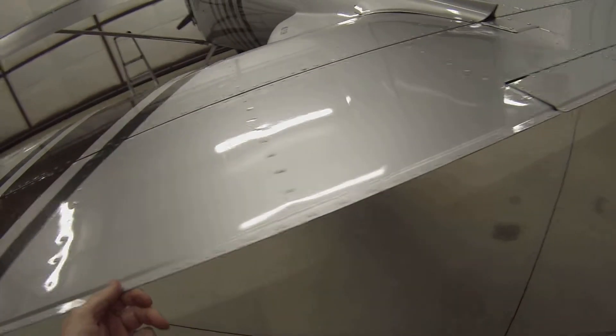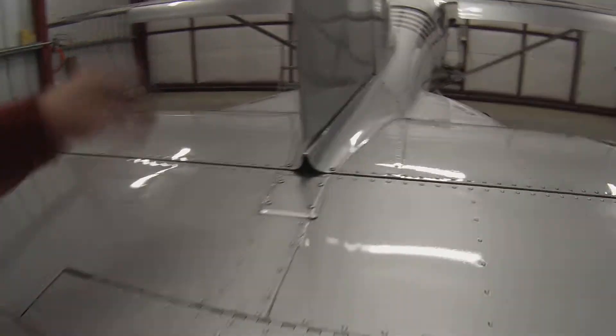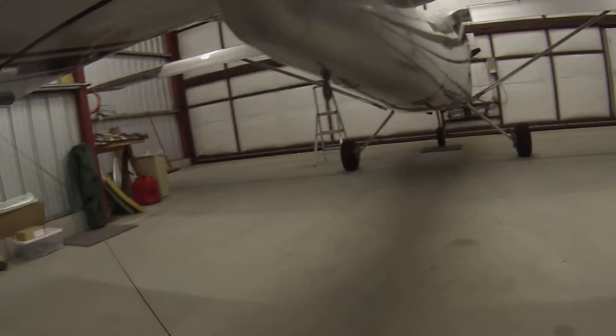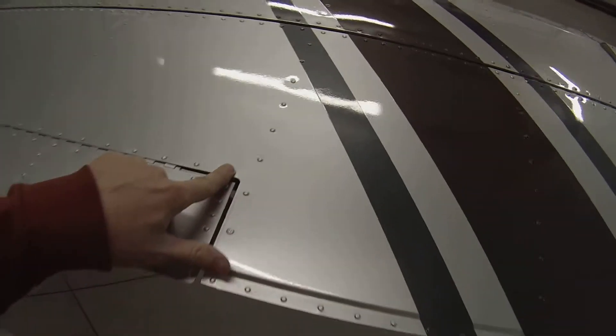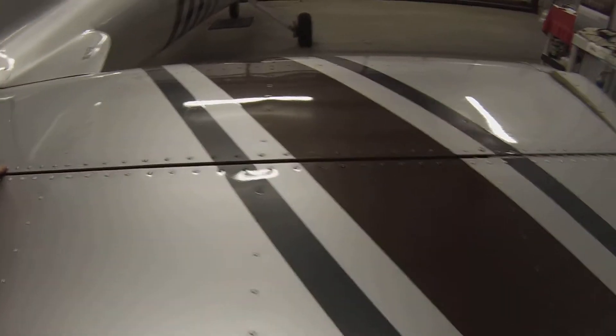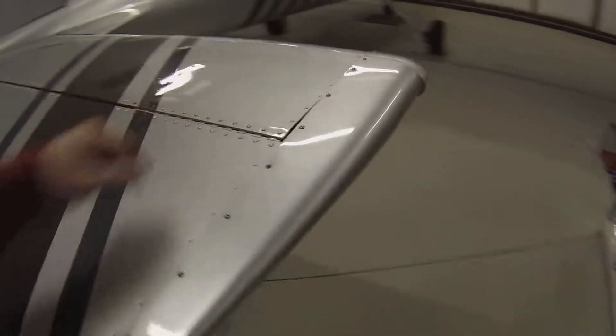I'll generally look at the condition of the tail, come back down, check the security of the fastener on the trim tab, also the tail cone — make sure that's good — and make sure there's nothing on the wire for the trim motor. Take a look at the motion of the rudder, make sure it looks normal, take a peek at the hinges. On the underside, check for no wrinkles in the skin, and check the security of the fasteners for the hinge system for both the trim tab and the elevator itself. There are screws that secure the hinge pins for the piano hinges — make sure those are in good shape.